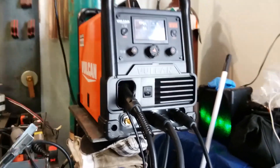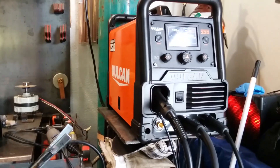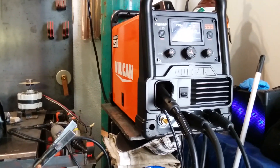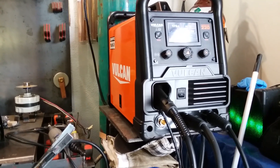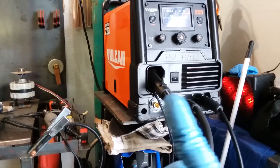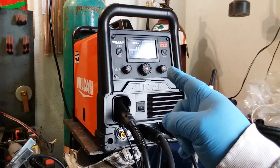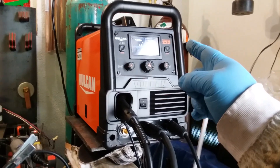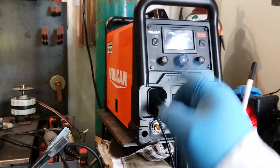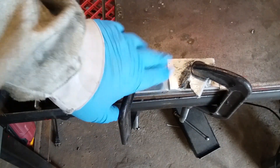In this video we're going to be doing a little bit of aluminum TIG welding with the Vulcan Omni Pro 220. You might be thinking that's not an AC machine, you can't weld aluminum with it — and you might be right. They do make a spool gun for welding aluminum, but in this video I'm going to show you how to weld aluminum with 100% argon using 175 amps. Since I'm welding DC, I won't get the cleaning action of AC.